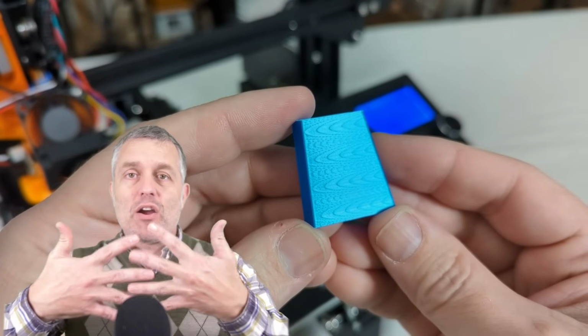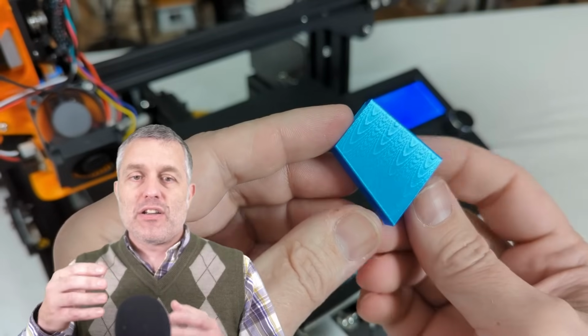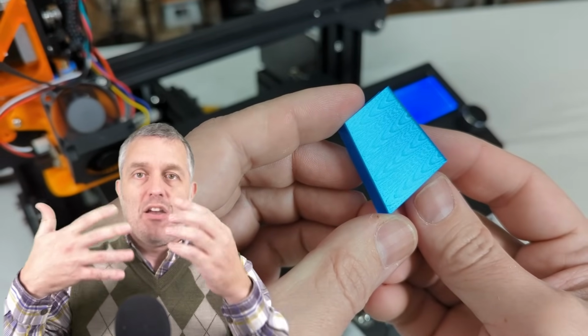But the problem with this dual drive is it's still directly connected to the extruder motor, so you're not getting the benefit of any sort of gear ratio, but also the hob gears themselves aren't any larger, and the 2 hob gears have to be synchronized together with a separate set of involute gears. And depending on how closely meshed those gears are, you'll get slop in those gears. And that slop there will exacerbate the witness lines that I've been talking about on your print from the teeth spacing on your hob gear.